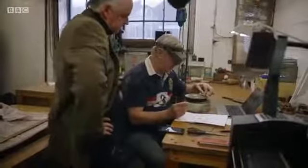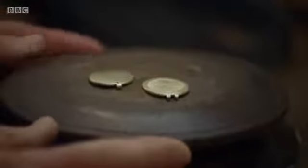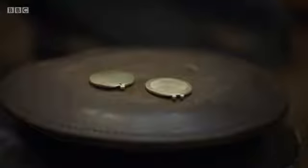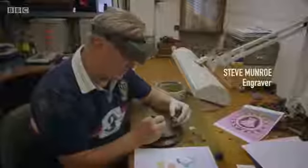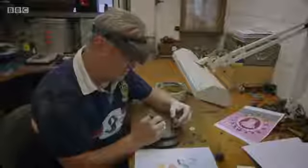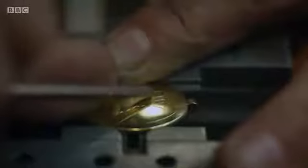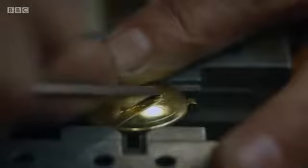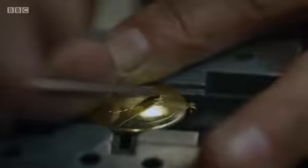On the other side of the workshop, the design for the engraving is finalised. So the plasticine goes onto the back of the paper. Once you draw through with a point, this will leave a fine line of plasticine onto the surface of the metal, which you then can draw over with a fine scribing line. And from the fine scribing line, you can engrave the outline that you're eventually going to cut up to remove all the background of the metal.